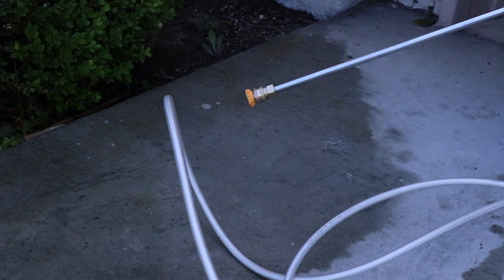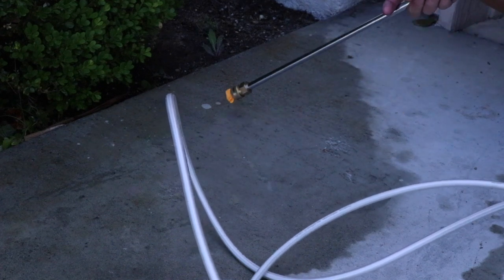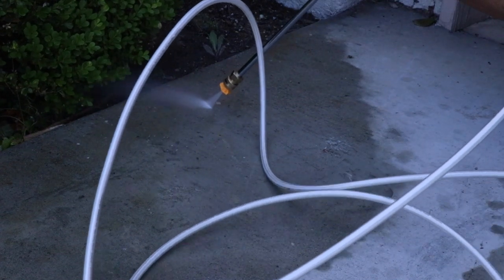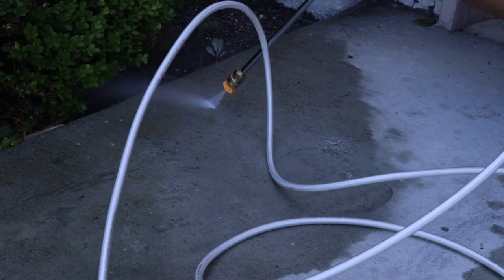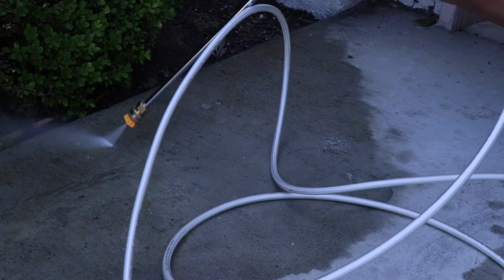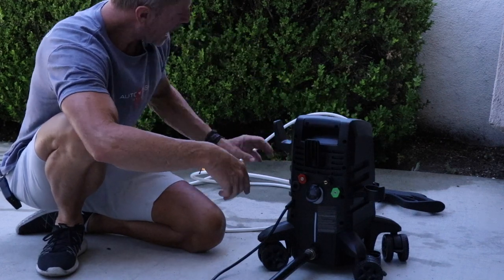What I'm noticing with this 15-degree is that it's the winning balance — it's going to remove these stains without removing the cement. This is where you maintain control: you have a choice of nozzle tips, and then you have the ability to go in hot or back off for more safety, less velocity, less pressure.